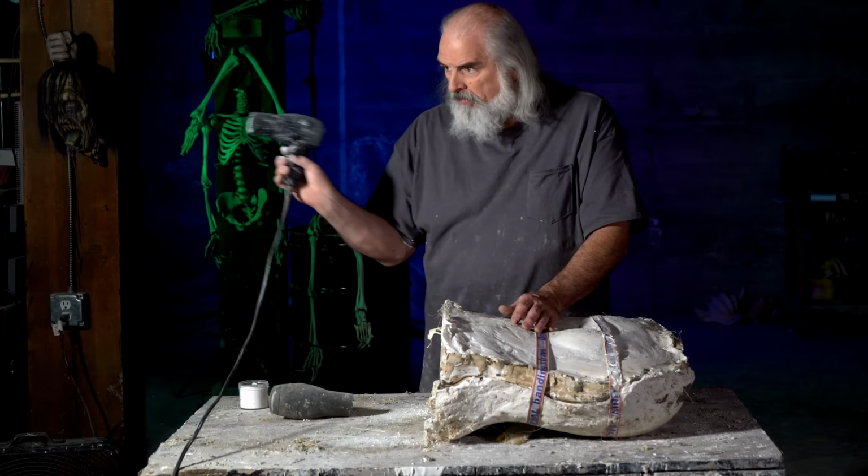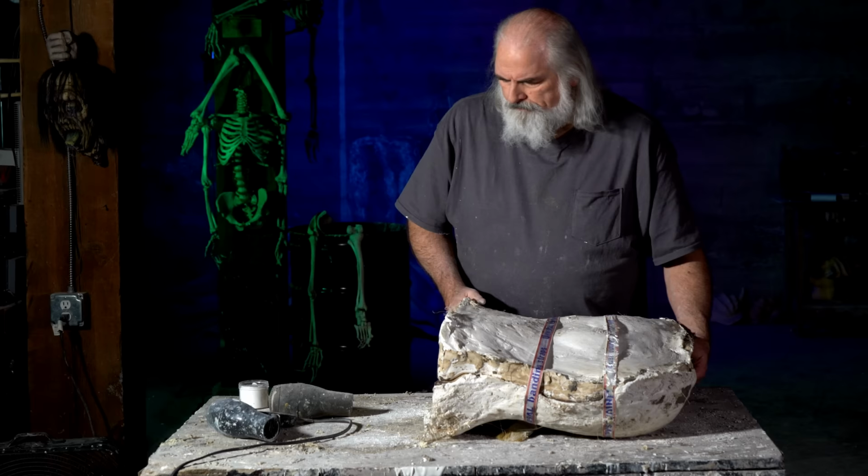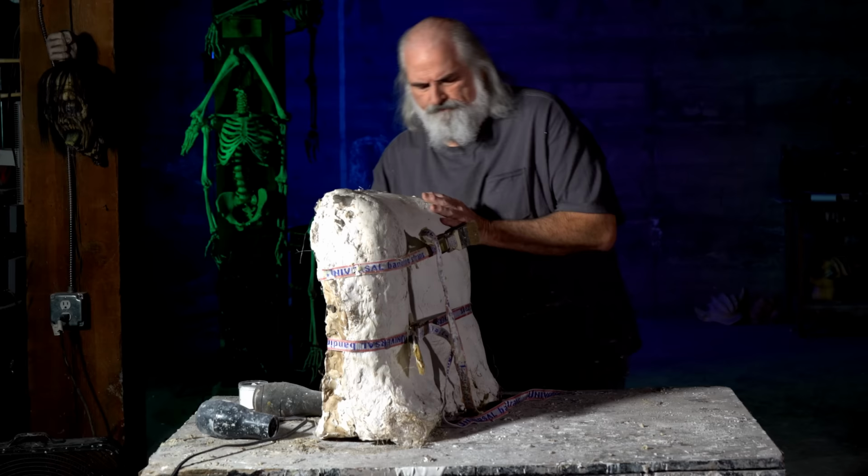All right, so I'm going to take back something I told you to do. As a company, we like to put both molds in, or both hands in one mold, because you find one mold, you can't find the other, they get the wrong one, you think you're ready to go, and they don't. So we do that. But these, especially since those fingers were long, they're a little clumsy. So I would say, unless you're going to be mass producing and things, you probably ought to do two separate molds. So I eat my words on that. I'm sorry. I told you differently, but I think you're probably going to be better off. They're going to be easier, because if they're too heavy and you're trying to manhandle it, you can chip the mold and all sorts of stuff.